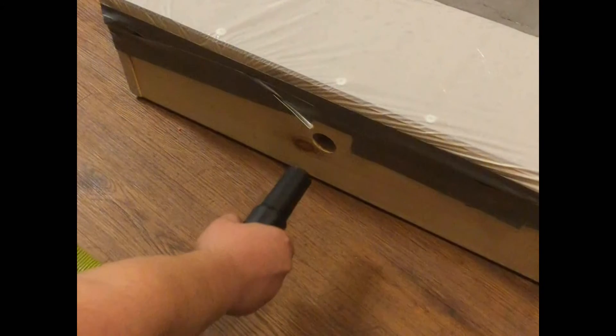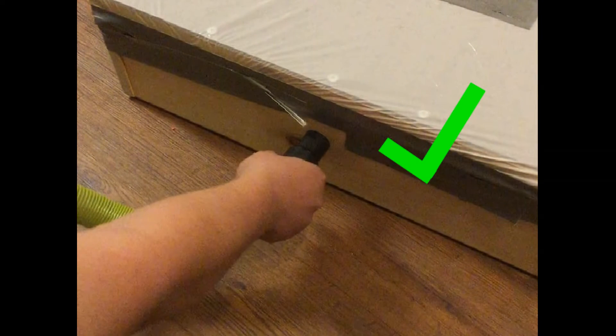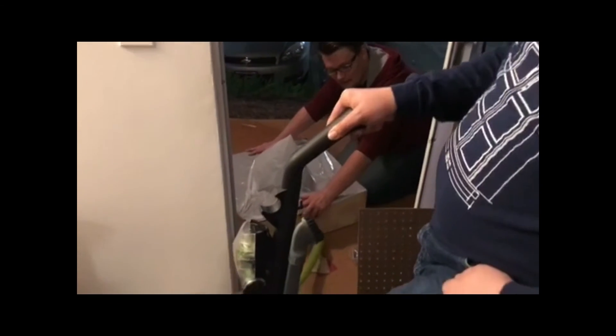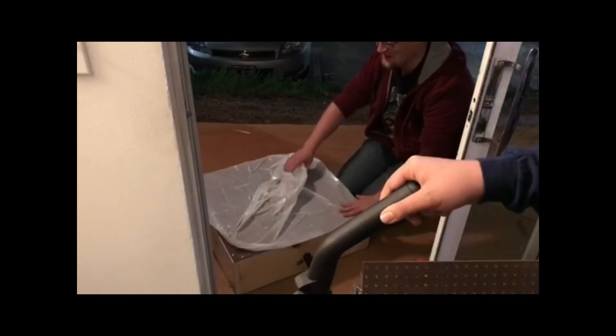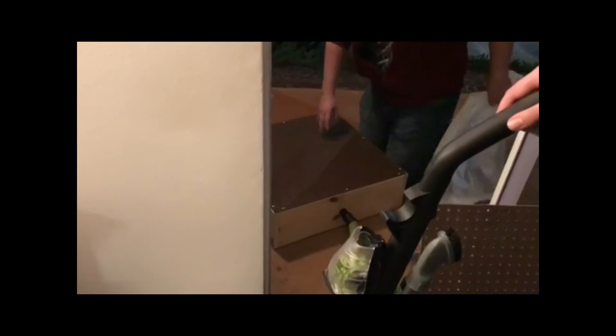This was the perfect size for the nozzle of a vacuum cleaner to fit nice and snug into it. To complete the construction of the box, we measured and cut the pegboard to act as the top of the box and screwed it to the open end using plenty of screws to better seal it down. We found the pegboard was fairly flexible and could possibly crack, but we had planned to be able to remove and replace the top plate if it ever wore out or broke.